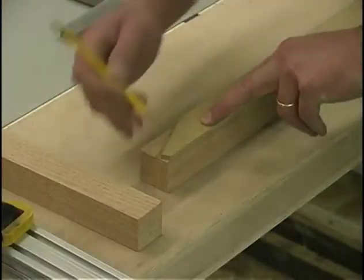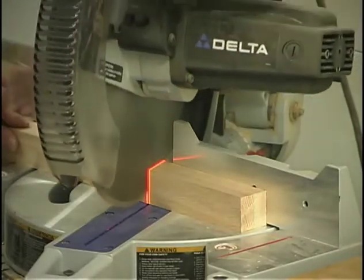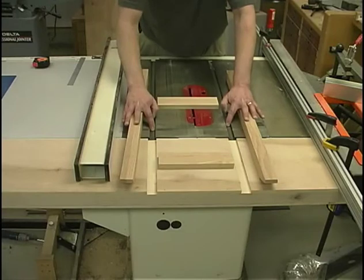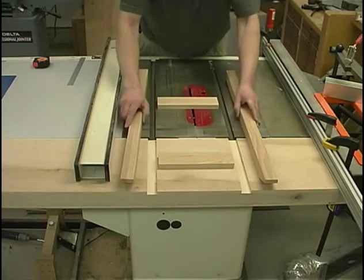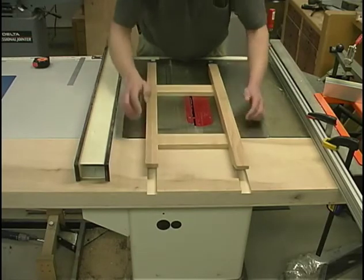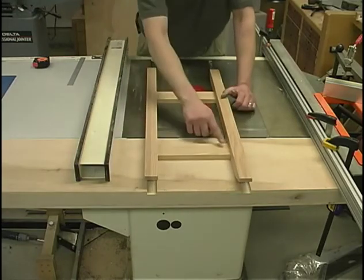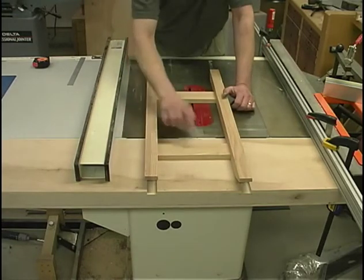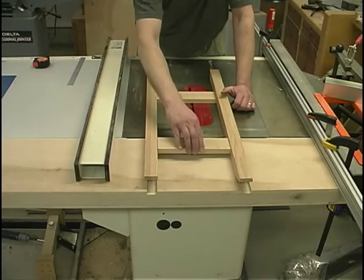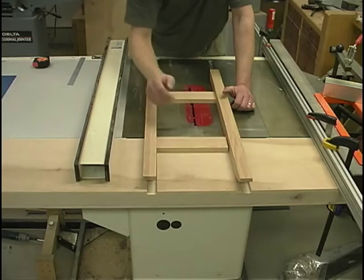Just line the template up nice and flush. Mark our angles on both ends. The center to center distance of my miter slots is 10 5/8. Now I want my two braces to be right on those center line points because we're going to attach it where we put in that triple thick ribbing in this area. Now to get that distance, I needed to subtract 1.5 inches, so that left me with 9 1/8 inches long for our cross bracing. Now it's just 3/4 inch thick oak, 2.5 inches wide, and cut off to 9 1/8 long.